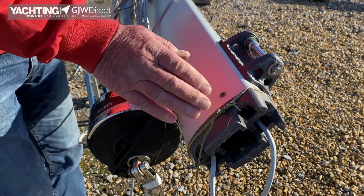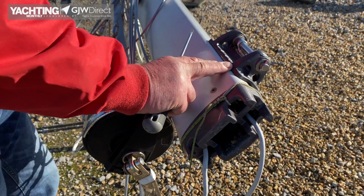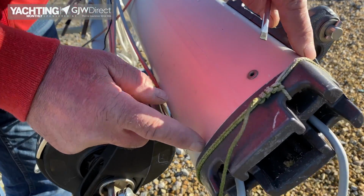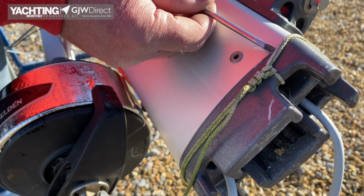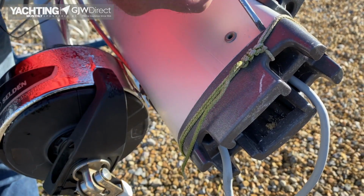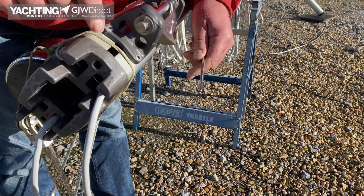So whilst we're here, down at the base of the mast, this is where all the compression from all the rigging and all the weight of the sails lands, here on this shoulder of the heel. So you want to be making sure it's landing nicely. If there's a little lip all the way around, I can feel with my screwdriver. So it's all good, and there's no bulging.